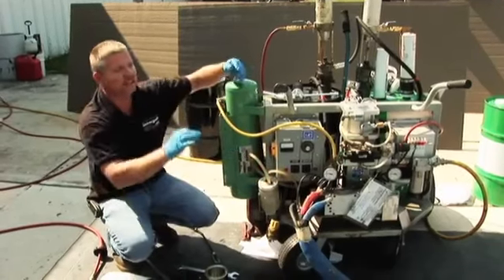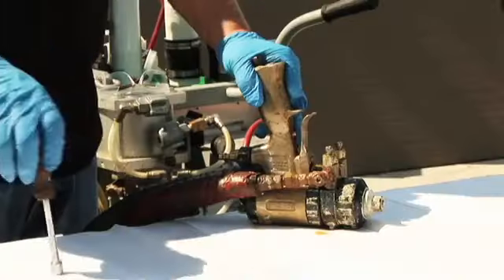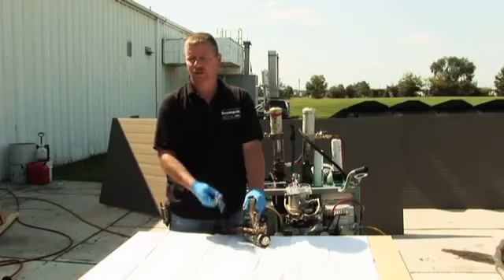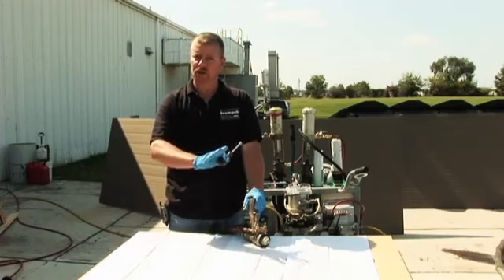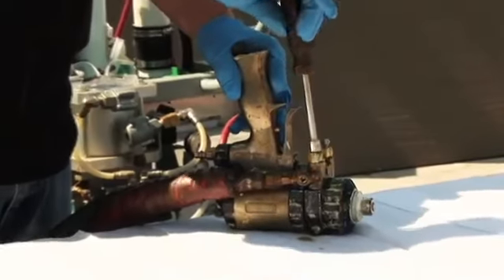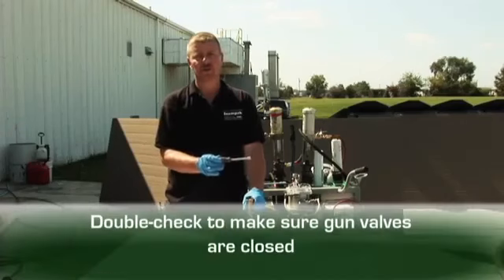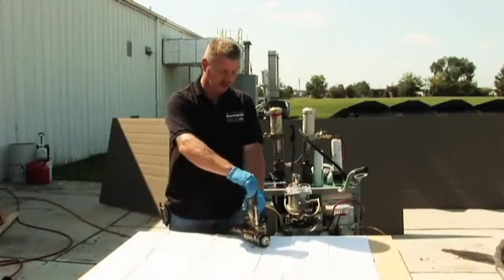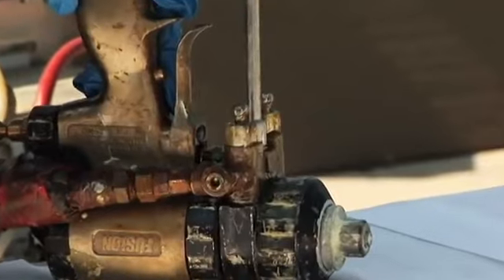Lastly, we're going to clean the screens on our gun, so we're temporarily going to take the gun off of the hose. For the last of our weekly maintenance, we're going to take off the gun to clean the screens on the gun. This is one of the few exceptions that the gun comes off the hose — normally it stays on. To do that, you always want to double-check that these valves are closed. If you take the gun off with them open, you're going to be covered with material and cross the gun over. Once you've confirmed the valves are closed, remove the gun by unscrewing the center screw that holds it onto the hose.